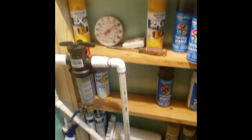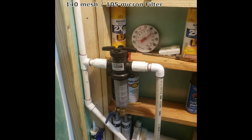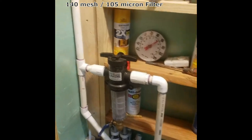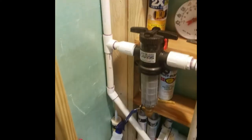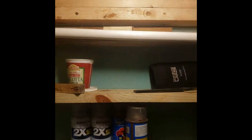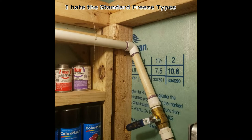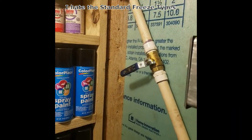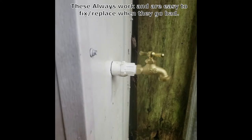The other mechanisms — I just got all the plumbing done. Used to, a little while ago, it went up 90, over, then 90 right back down. I just got around to getting all the plumbing installed, so it comes up where that valve is right there, comes up out of the ground from the well house, runs through — I think it's a 30 micron or 300, I can't remember — then tees in after it's filtered and goes into the house. And if you want to know how to make a really good freeze-proof faucet, there it is.